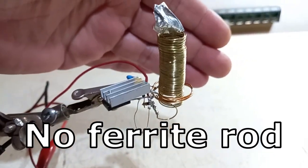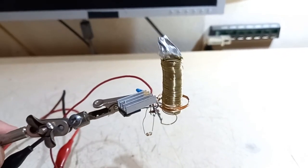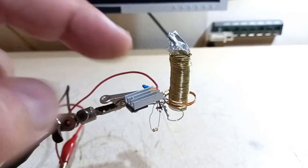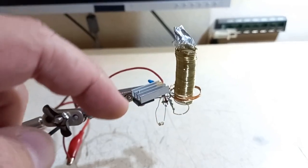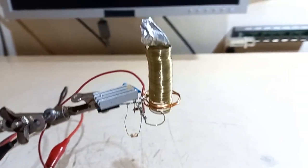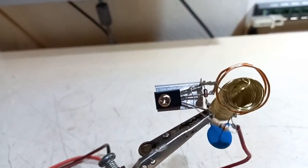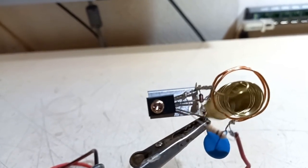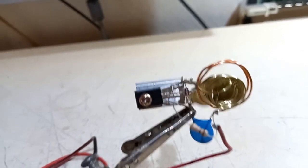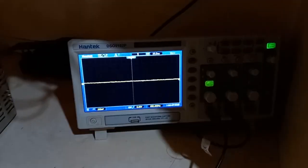The secondary is just 56 turns of aluminum wire wound on a former of about one centimeter. It's free, not sustained. I had to fit a small top load because the top load increases the feedback effect on the bottom of the coil to drive the base of the transistor. There are two turns of copper wire as primary — pretty simple. The transistor is a 2N2222, actually a fake transistor that was supposedly a BD139, but I characterized it and it's actually a 2N2222.